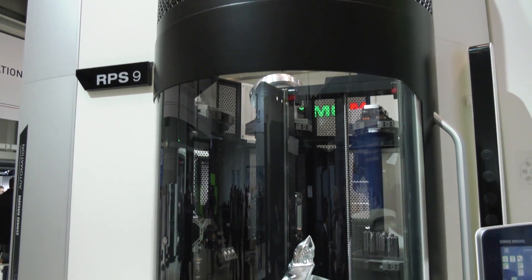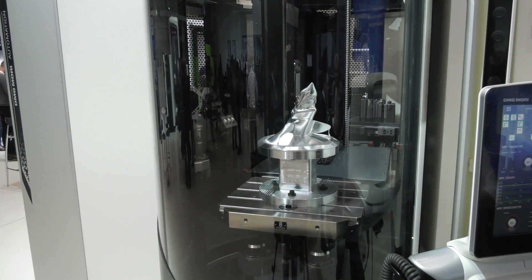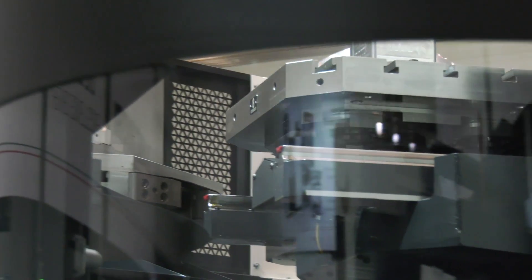On the universal element — you also have the flexibility of the pallet system here. Let's touch on the RPS, a nine-station pallet system. The machine is standard with a five-axis configuration featuring a double-supported swivel rotary table. A key development target was openness to any kind of automation system. Here you see the DMU type, which you can usually enter from the front and operator side. We integrated in front of it a rotary pallet storage system with nine pallets on two levels, loading with a rotary pallet system directly into the working area.